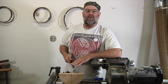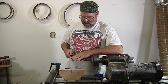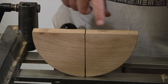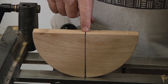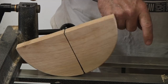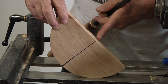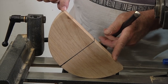Now neither this nor the Tracy Owens tools are roughing tools. They do look kind of similar to scrapers, but I would not use them as a scraper. The primary thing with using any tool: you want it to be balanced on the tool rest when you're cutting, which means the part of the tool that is cutting is directly over the tool rest. If you figure this is a section of the half-round flute, this is balanced just like that. So if you're cutting with the center, fine, it'll stay balanced. But if you're trying to use that as a scraper and you're cutting on one edge, it's going to want to tip on you. So when cutting with this, I keep it at a 45 or higher degree angle. Just like when you're using a skew chisel, this is your center line — you always cut below the center line. If you get up on top or above the center line, it's going to want to tip on you.